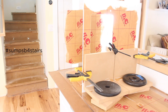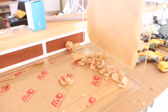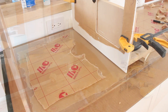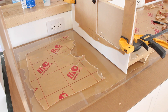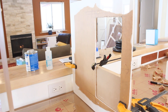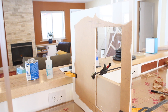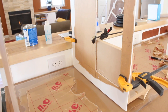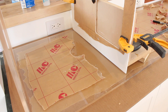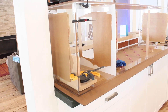As you start the glue-ups, you just need to make sure that the ends and the baffles that you're putting in as the first step are perfectly vertical. You can use anything — I've made some little MDF pieces and I'm using some weights and clamps to make sure that things are perfectly plumb. And it's really useful if you have a very flat reference surface to glue on. I'm actually using a kitchen countertop, which is a granite slab — should be perfectly dead flat, great reference surface.